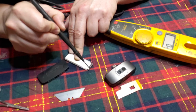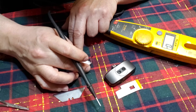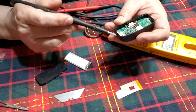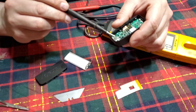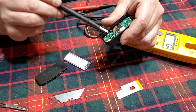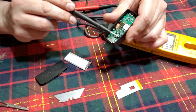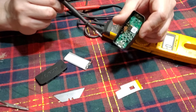And the same thing on this side — power goes in, small switching, ground. Some of that's for power in, has to switch back for power in. So when you're putting the USB on here, it needs to be able to switch these chips to charge the battery. And then when it's charged and you unplug it, it needs to switch again to bring the power out of the lead into the device so you can actually operate the device.